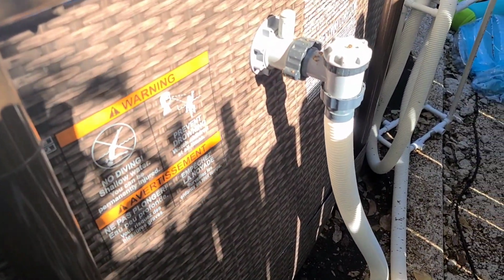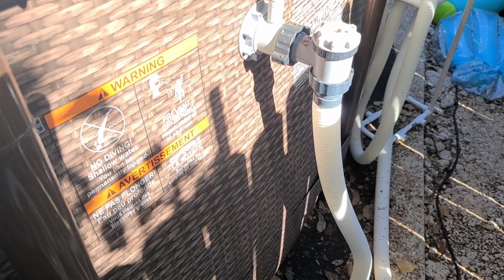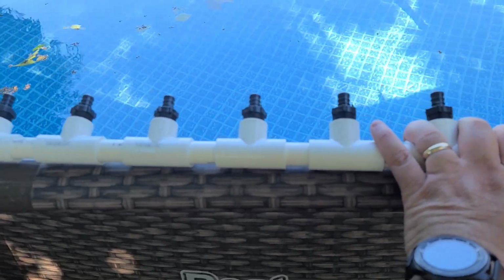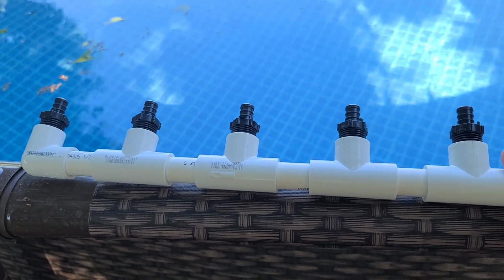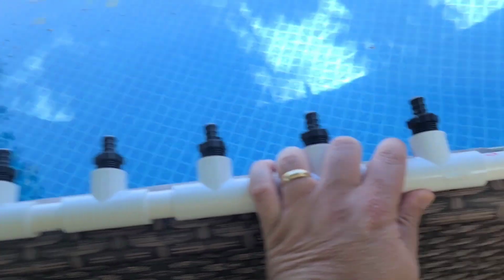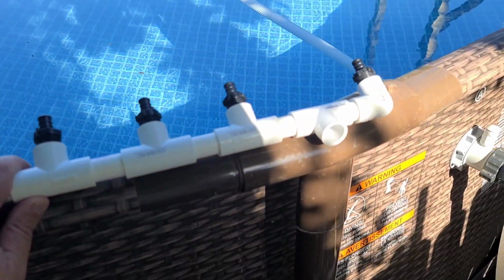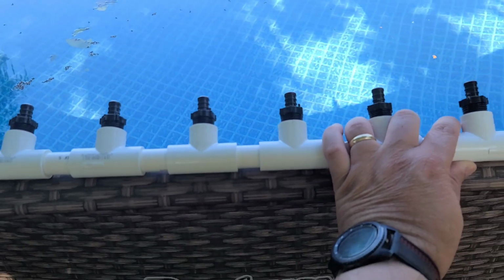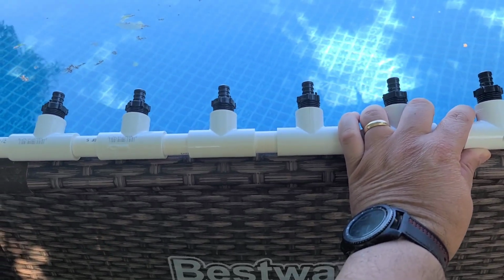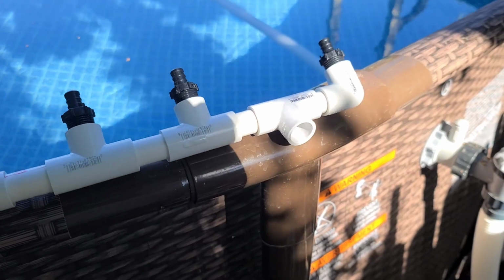This particular T-junction is going to kind of run down that pipe, elbow over, basically connect over to the pool outlet there. So just wanted to see what it looks like actually before it's all done. Each of the PVC connectors in between the actual T's and such, those are 2 inches each. And as you can see, it's about 36 inches all the way across. And again, the idea is that this will now go straight down, pull there, and cut across. So it's going to set here right on top of the rail. I'll probably zip tie it down to hold it in place. I'll adjust the particular angle so this is going in the right direction.